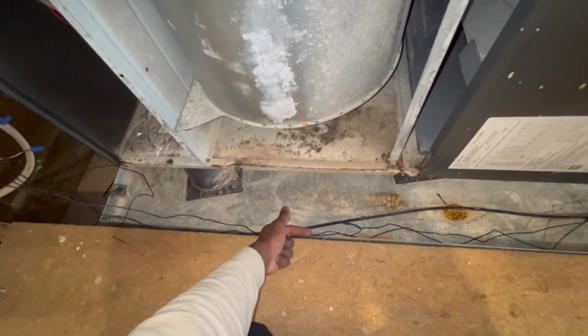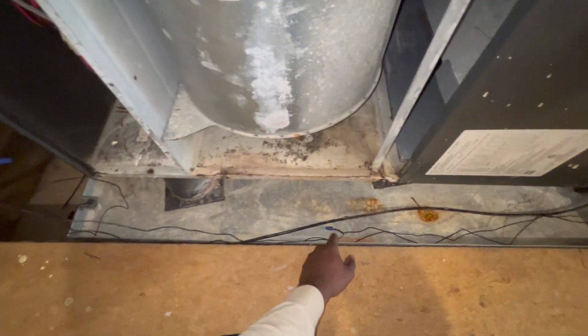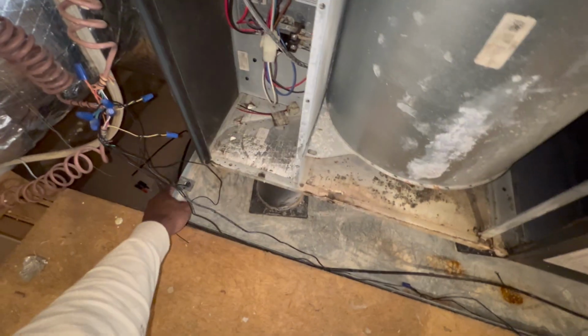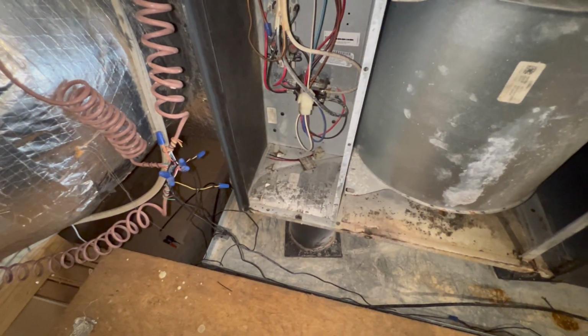It's also got a float switch right here for this drain pan. So if water tends to fill up, if this drain line is backed up for this drain pan for the unit, this should raise up and kill the operations. And of course, this is for this one. And this is basically a secondary, because I wonder if this one quit and the water just overflowed on this pan. That should be a backup and all that. But anyway, yeah.